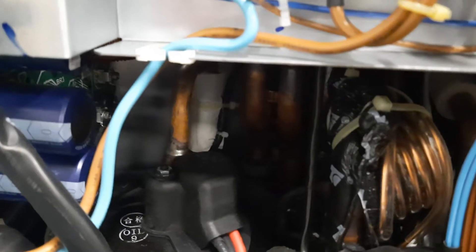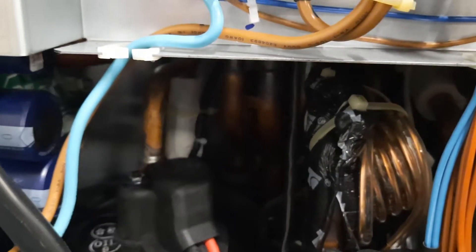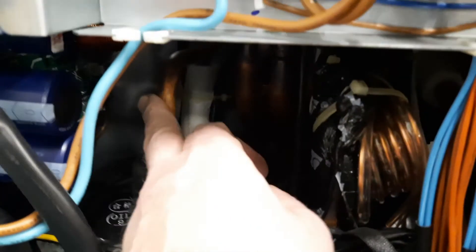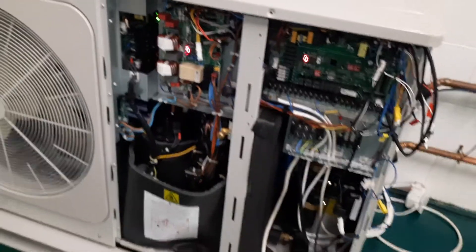So if this trips at 115 degrees C, it means we've got water coming out of the unit at around 70 or 75 degrees, which is higher than the unit can cope with. But normally, you find the water out the back is cold and this pipe is exceptionally hot. What that indicates is you've got refrigerant volume problems — essentially, you've got a refrigerant leak.